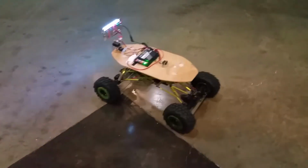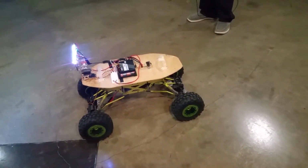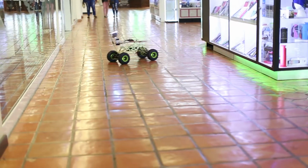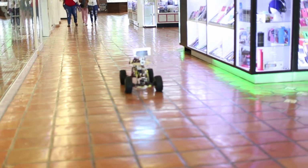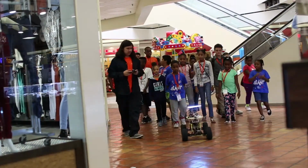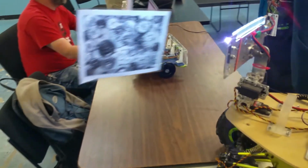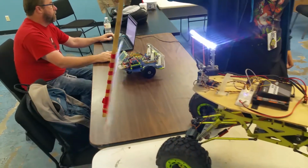This robot is based on a 1/5 scale rock crawler and has independent steering and motors on the front and rear axles. So we are using 2 motor ports configured as unknown motors to control drive power. There aren't any encoders on these motors. We are also using 2 servo ports to control the steering. We needed to add rear steering because otherwise it had a very poor turning radius. We are also using 2 more servos to control the pan tilt setup for our phone camera mount.